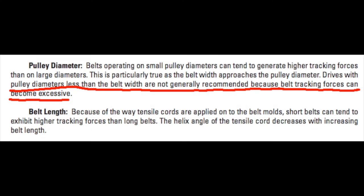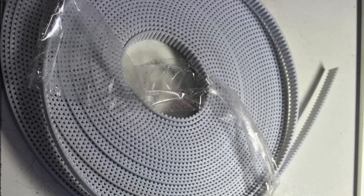I also picked up a useful little tidbit from some documents I was looking over, and I can pass that test information on to you. If you're switching out your belt and wondering if you'd get any benefit going to the white polyurethane stuff in terms of ringing, and you have a similar setup to mine, you probably shouldn't bother. Just get the regular neoprene belt and save your cash — it's easier to work with, easier to cut, and you don't have to worry about running larger pulleys.